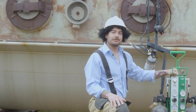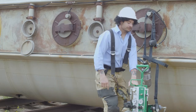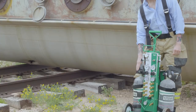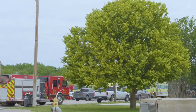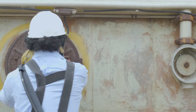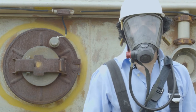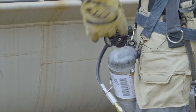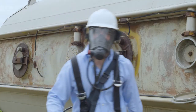So when your low pressure alarm bell goes off, whoever is manning your cart should always turn your spare bottle on first before turning your bottle off to be replaced. If ever you have a failure in your supply line, this is not a happy little accident — you should immediately turn on your bottle, disconnect your supply line, and exit the hot zone.